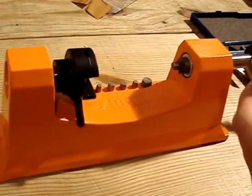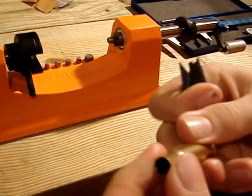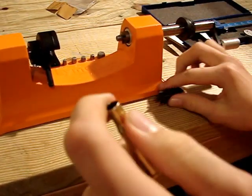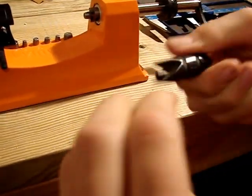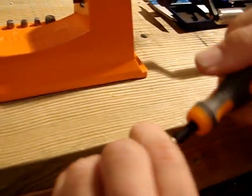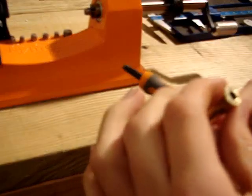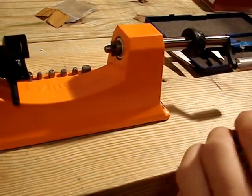So I got the proper case. I'm going to get my deburring tool — debur the inside and debur the outside. Now it's all deburred and ready for priming and reloading. Actually, that primer pocket's a little bit dirty. I'm going to clean it out. Now it's a bit more clean. This case is done.